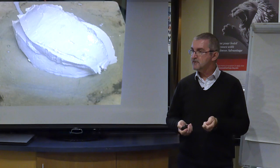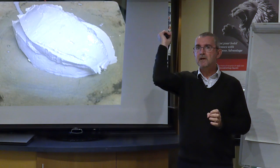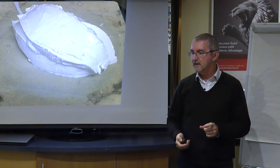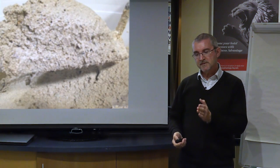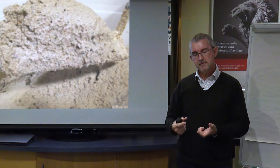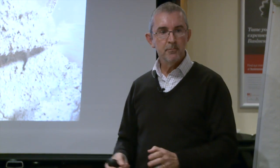And this is the starting process for doing anything, whether you want a lime mortar, a lime render, a lime plaster for your ceiling or walls, it doesn't matter. They all start out in this way. And the only difference between a lime mortar that you're building your wall or your stone with, or a lime plaster, then maybe you want some really fine detail in maybe a moulded ceiling, or you're striking a cornice, the only difference between any of these things is the sand that you put into it. So when you put sand into your mortar, at that point you are changing the purpose and the use of your lime into whatever you want to do with it. But before that point, before you put the sand in, it can be used for anything.